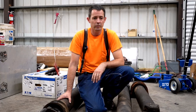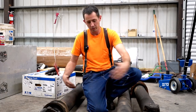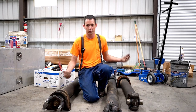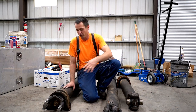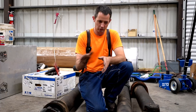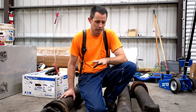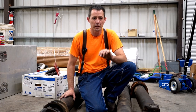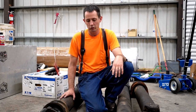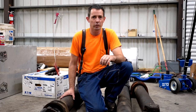If you've had a vibration you haven't been able to find and you've looked at everything, it doesn't cost a whole lot to have these done. There was a little bit of labor taking them out — this thing is like 12 feet long all together, so I had to break it all down and mark each piece for its position so it goes back in right, keeping the u-joints from binding up. The dyno balancing itself was about $350. With my labor putting it back in — about two hours — all in it'll probably be around five to six hundred bucks, which these days isn't a lot to finally solve a problem.